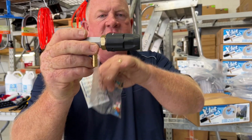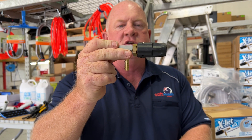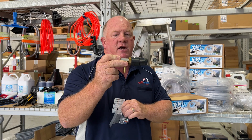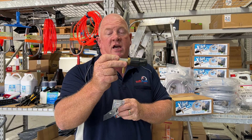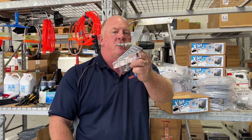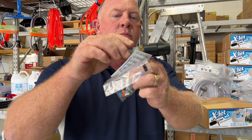What's the M5 bit? That's the funny little end bit. What's the X-Jet do? It's a Venturi system. Goes on the positive end of your gun, so you can use high pressure, and it'll basically pull up a soap into the mix or the stream, and allow you to apply it to a housewash, or if you're laying down any other solution. It's got a quarter inch quick connect that just goes on to your gun. That's how it all mounts up.